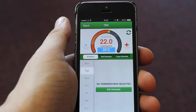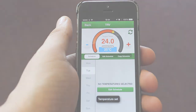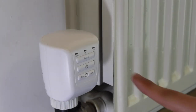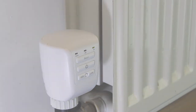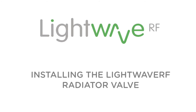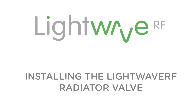The app will instruct you on how to set temperatures and schedules. The TRV also has manual controls. Pressing the boost button will raise the temperature a couple of degrees above the target for the duration of one hour. Pressing the standby button will toggle the TRV fully on or fully off for one hour. We hope this video has been of help. Thank you for choosing LightWave RF.